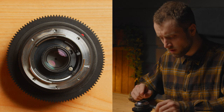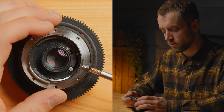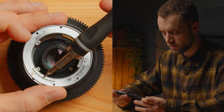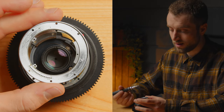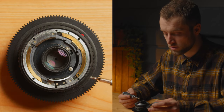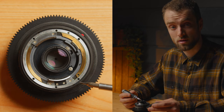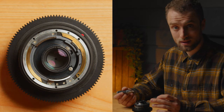Now you can take off the original Leica mount. Once you take this off, there's one thing you'll notice: if you flip the original mount over you see these little grooves — those little grooves make the clicking sound of your aperture ring. I already took out this little ball, but if you do this for the first time you'll see that right over here there's a super tiny metal ball with a spring underneath. Take it out — take that ball out, take the spring out as well — and now technically your lens is de-clicked.